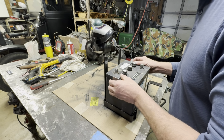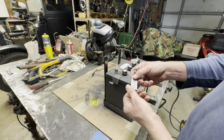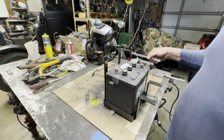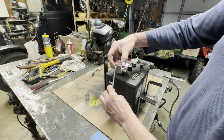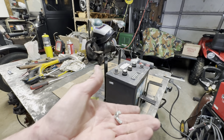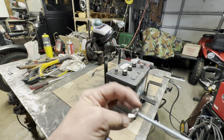So a couple hold down clamps, a couple of these guys, little biscuits, just cut them off with some flat steel. We'll stick these down here, making some sense. We'll weld a threaded rod on so that it drops through about 1.5 inches. So that threaded rod will get welded onto here, onto the clip. And then from underneath, we will just use some little wing nuts. I think this is 3/8 or something like that. Small stuff. So there you go. So you do a little bit of welding, finish up.